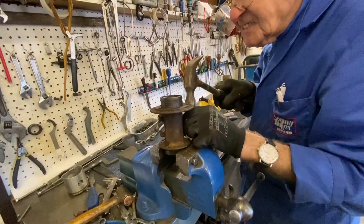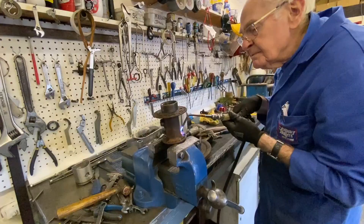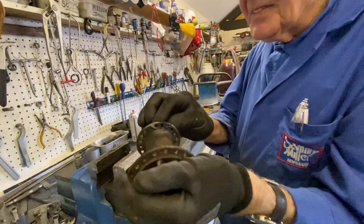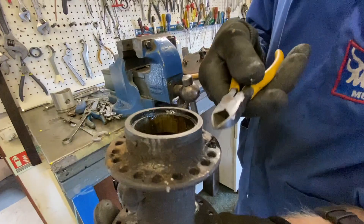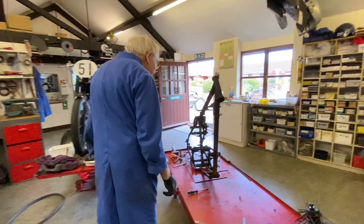Then we'll have to re-weld the lot back together again. Still quite tight — I thought that would have come out. Maybe put a little bit of heat on it. Right, I've got one — so nearly out. What we'll have to do is re-weld that properly and then redo the holes, because that weld is very poor quality. Obviously it's cracked across there — probably due to someone over-tightening the spokes and they've just ripped the thing apart. So anyway, we're pretty well up to speed. We'll drop this apart, get it ready for grit blasting, and then the painters.